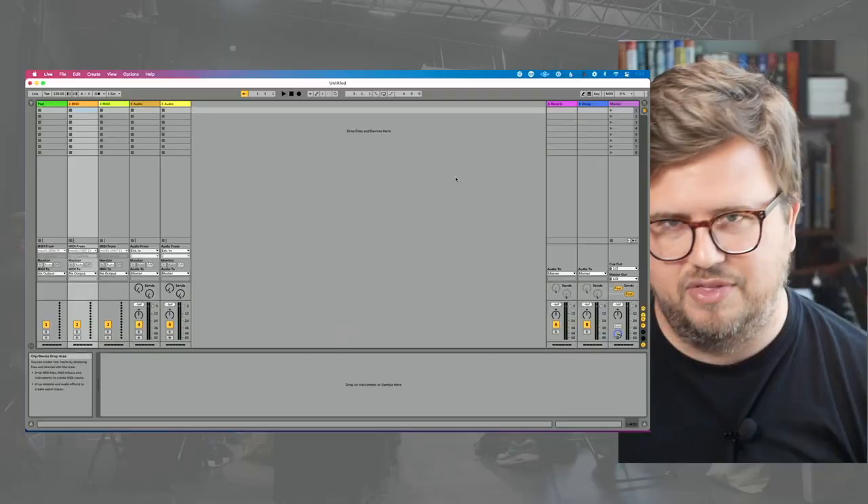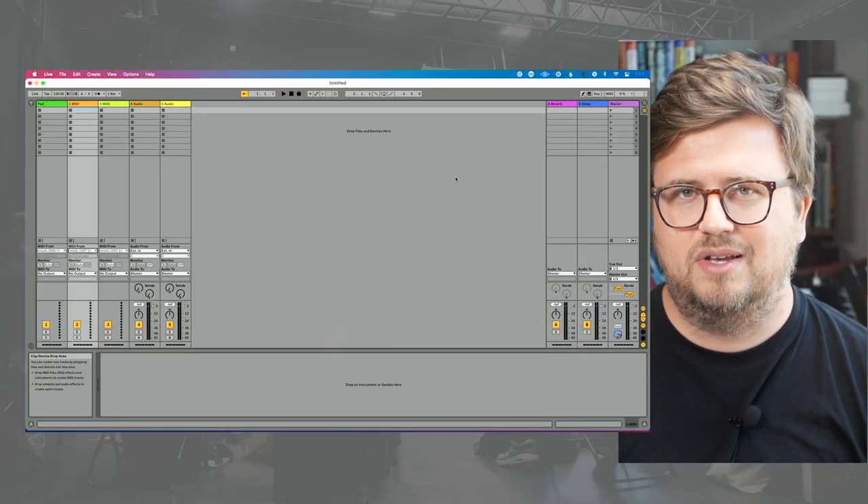So at this point, we're talking about a lot, but these are very simple steps that we build up to create what could potentially be a complex scenario with lots of MIDI everywhere, made very simple with one Ethernet cable. We've established a connection from our devices to our Mio XL, from our Mio XL to our computer — discrete connections, all over one Ethernet cable — connected to our computer through those network sessions. Now we need to go into our DAW and say: receive MIDI from here, send MIDI to this port.